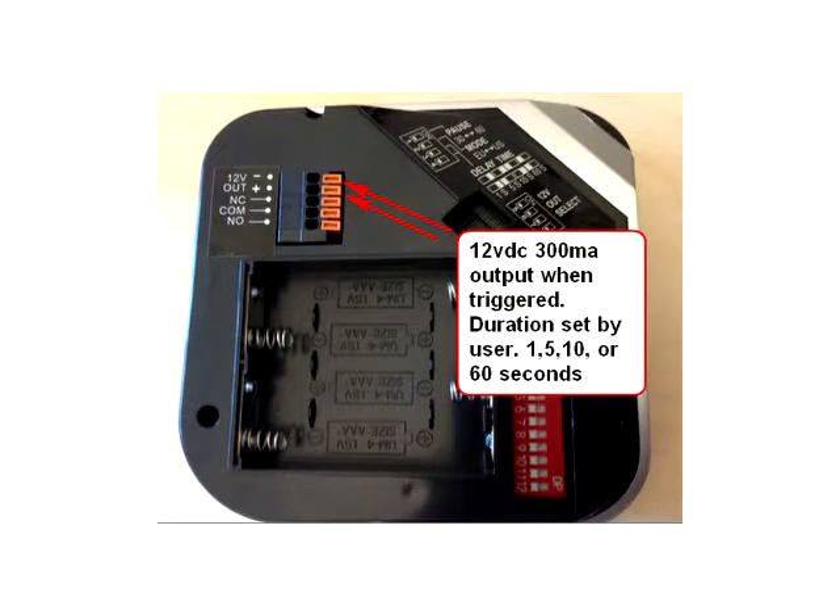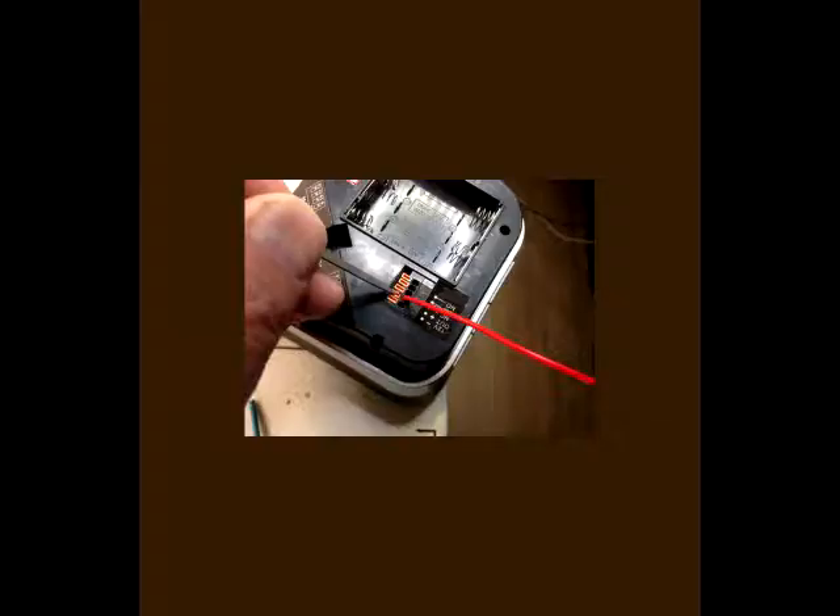This view shows the back of the receiver where the external 12 volt DC pins are located. Those pins are miniature versions of the kind you find in the back of AV units and speakers. I found them to be a little delicate. You need to depress the orange part to open up the jaw then slip the wire down into it. I found I got the best connection by tinning the stripped wire end.